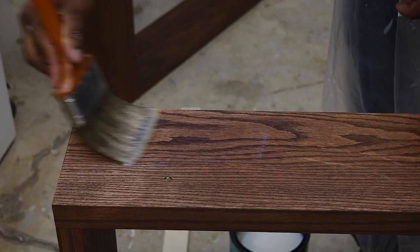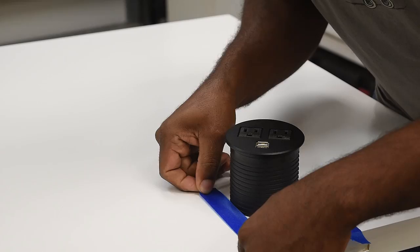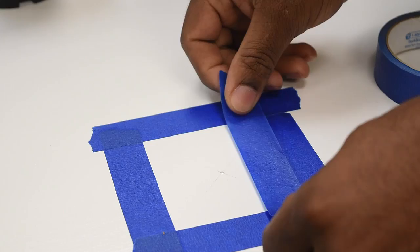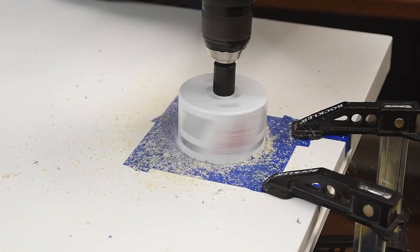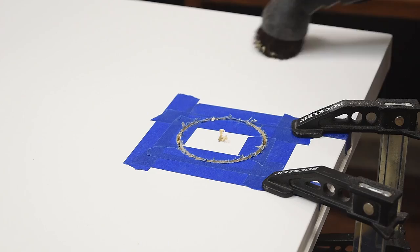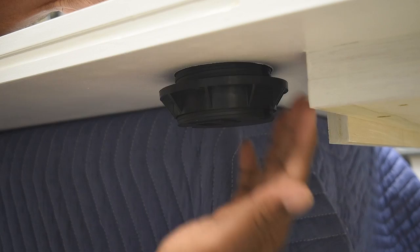Polycrylic is a great top coat for paint, stain, and many other finishes. I added two light coats on the legs — I just didn't want it to be as shiny. As a tip, you're going to want to apply the polycrylic in a dust-free zone because anything that falls in it will stay in it and you'll see it. I wanted this desk to have some kind of integrated power that was quickly accessible. I found many power grommets but this one had the simplest and cleanest look. To protect the surface I used masking tape and placed a piece of wood at the bottom to protect against chipping, then drilled out the hole. I had a three-inch and a three-and-a-quarter-inch hole saw but actually needed a three-and-an-eighth-inch — either way the hole still needed to get drilled. The masking tape provided a really clean hole, and the grommet fits right into place with a nut at the bottom to finish it off.